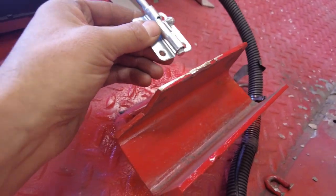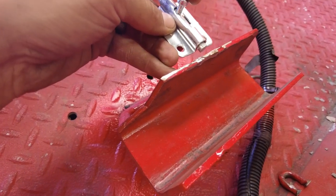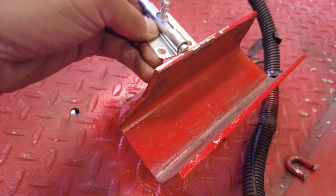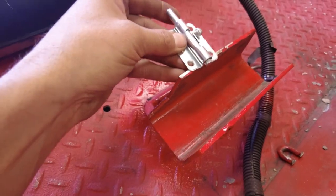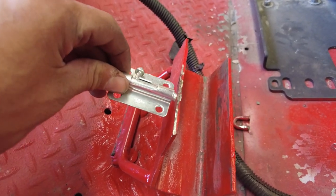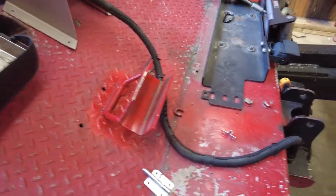We got the leftover from those little chain links ground off and now we're gonna take these pieces — they're gonna need to sit right here so that when you flip this up, that goes down and now that dolly frame is locked in place right there. Then you just flip them up and it's unlocked and you pull them out. I'm thinking just take a piece of angle iron, weld it to this, stick out right here, weld this to the top of the angle iron and we're pretty much done. So let's find a piece and cut it up.